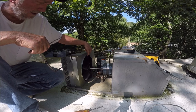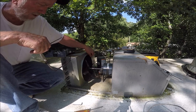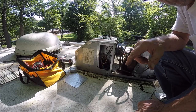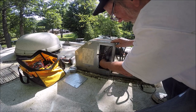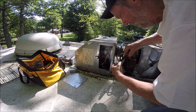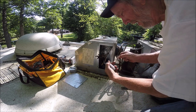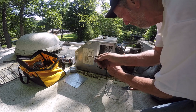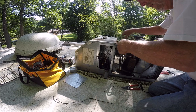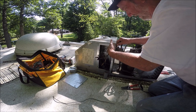Notice how it nicely turned. Position this fan to the same amount it was sticking out before — before you take it out, look and see where that fan was. First thing I'm going to do is take the solid brown and the brown with white tracer and connect them to the capacitor. The capacitor is over there — take a tool and pry it up. Pull it out like this, then put the brown wire through the hole. There's the white with brown tracer — stick it through there, doing one wire at a time so you don't get confused.